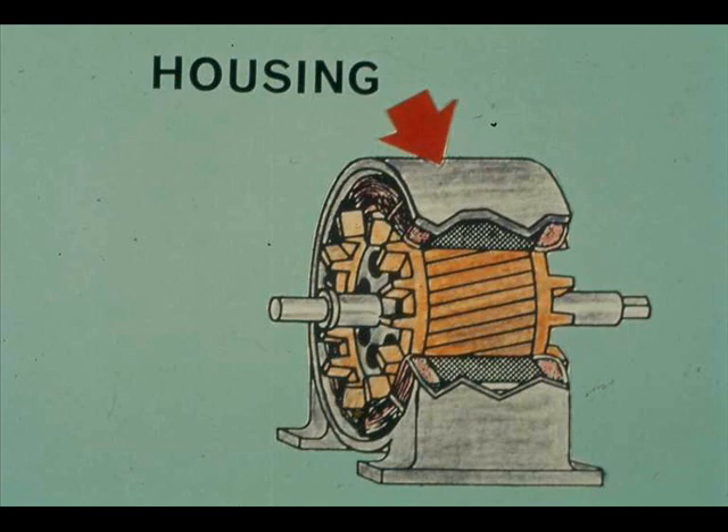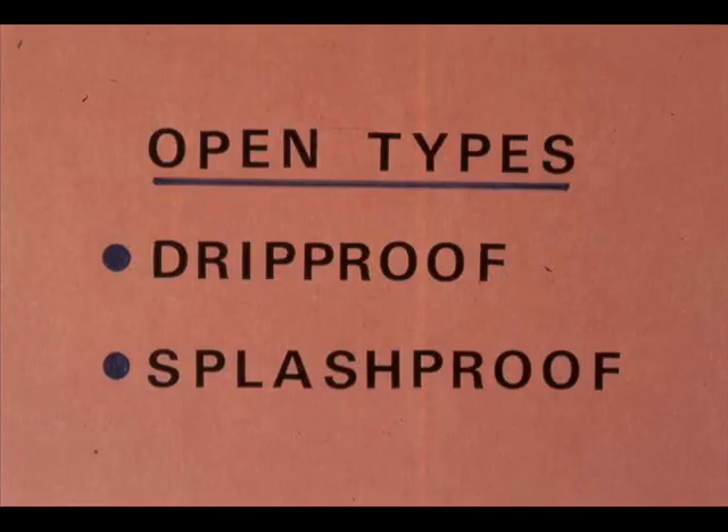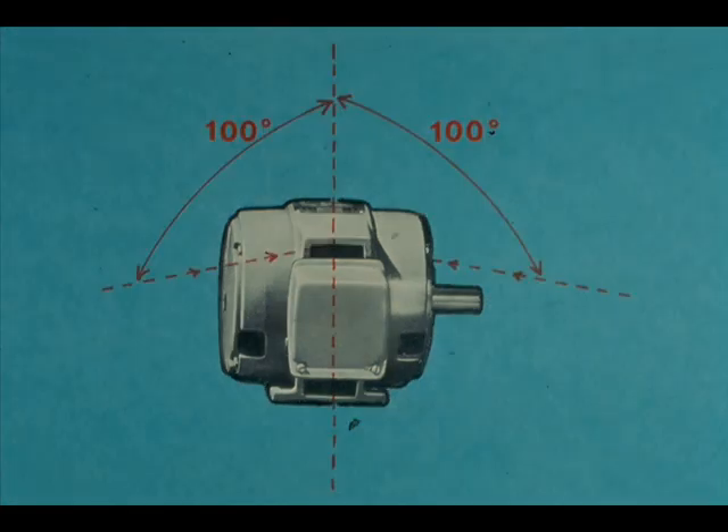The operator of an AC motor may not think of the motor enclosure, or housing, as a safety device — it is, though. Motor enclosures vary in design as required for safety in their services and locations. Broad classifications of enclosures are open and totally enclosed. An open motor has a housing but is designed to allow outside air to be drawn in and to come into direct contact with the motor's internal parts. Most open types are drip-proof or splash-proof. Drip-proof types have ventilating openings so constructed that the motor can operate successfully when drops of liquid or solid particles strike or enter the enclosure at any angle from the vertical to 15 degrees downward. Splash-proof motors are similarly constructed, except that the angle of protection extends to 100 degrees from the vertical.